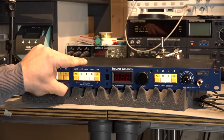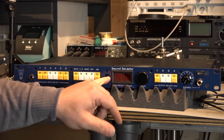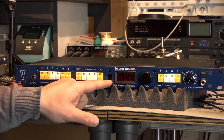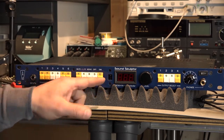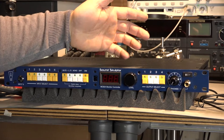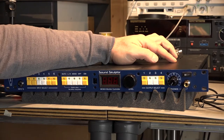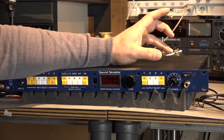The next quality issue on the front panel is this window for the infrared sensor. The edge is so sharp it can even cut my finger — I'm telling you guys. A really nice advice: just cut a circular hole here, and then make the edge a conical shape. The next one is really just an advice: it would be much nicer if we got some adjustment possibilities on the power unit itself, where we can tune the power rail to absolutely match 16 and minus 16 volt.